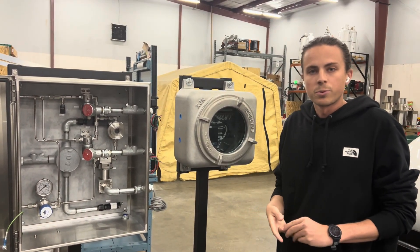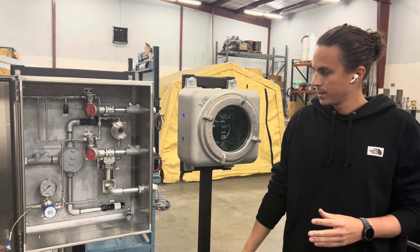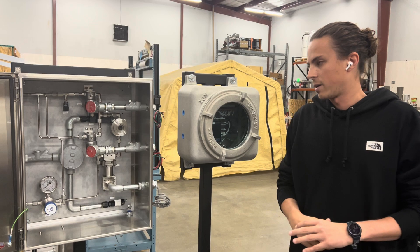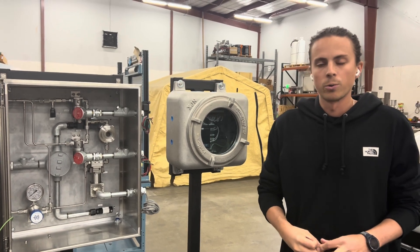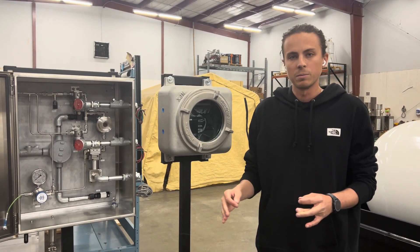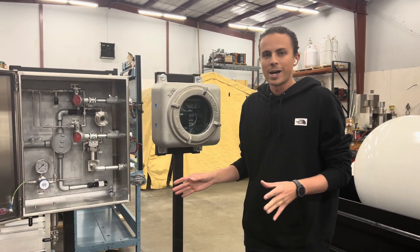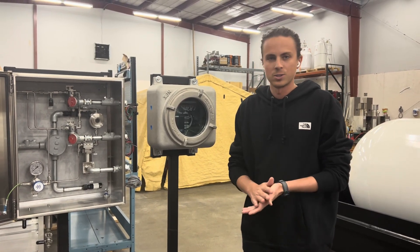Since this is a differential pressure unit, we are limited by the pressure on our bulk tank. This unit can deliver up to 250 pounds of pressure on our injection point. We also have a high pressure GPL 5000 which can go up to 400 pounds on the pipeline or injection point. At a standard half pound per million, this unit can effectively odorize up to 20 million cubic feet of gas an hour and can go down to a thousand cubic feet of gas an hour. So it's really versatile and the newest odorizer to join our fleet.